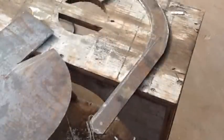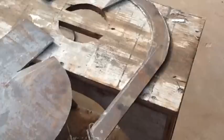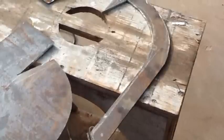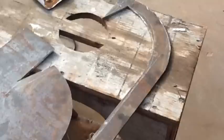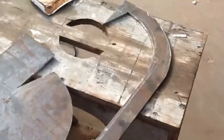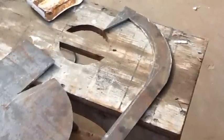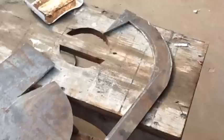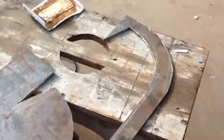I laid out the flat plate with just a piece of chalk, and drew the hook to about an 8 inch radius to get the curve. The important thing with the hook is that the point be parallel to the long arm — you want that point aimed in the same direction as the long arm. The scrap that comes off the outside of the curve makes a nice sharp little point that you can then weld to the end of the pipe.